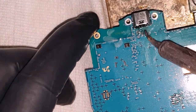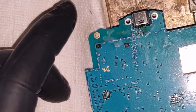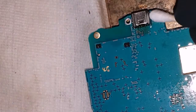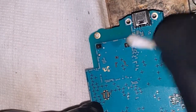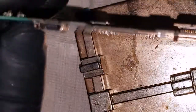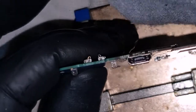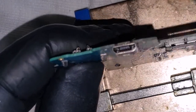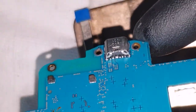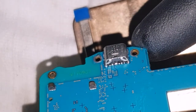I'm happy with how that looks. Let's bring in the isopropyl again and give this a clean — spray it on and go around the edges with a q-tip. Don't press too hard or you'll knock off nearby components. Let's remove this from the PCB holder and have a look. I'll do a test with my tweezers — that's solid. You can see clearly it's soldered on perfectly. I avoid using the heat gun here because of the plastic part inside — I don't want to risk melting it.